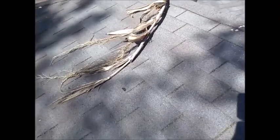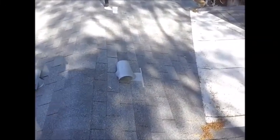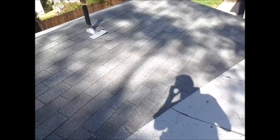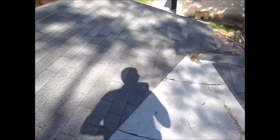So typically the ridge caps will burn out and deteriorate at around 5 or 6 years. So I'll count the layers when I go down. On the top here, they've changed out some of the shingles. In the back of the house, these are all newer shingles, and inside the valleys here they've replaced those. So the front of the house is still the original roof, and in the rear of the house they've replaced the composition shingles.